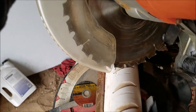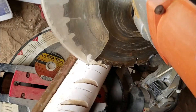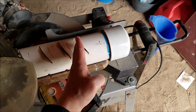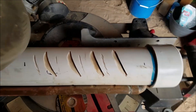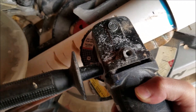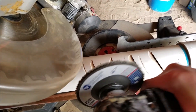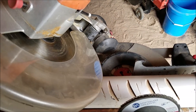When you come in on the pipe, you're going to want to come in center on it. Just hold it in center, come in down on it, and make your angle cut spaced about two inches apart. Then I took an angle grinder and just went around and peeled it back in order to help it move up and down the pump — just keep bumping it up and down, shifting the sediment, and it will keep pulling it up.